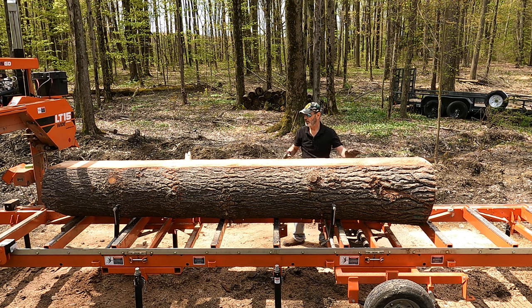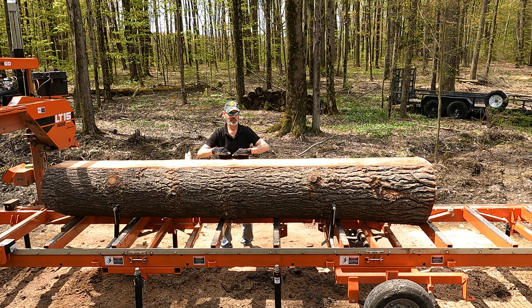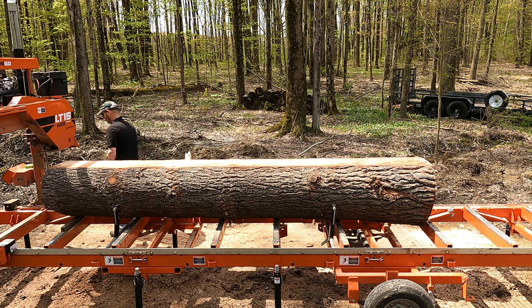And these edge cuts, I'm going to go down an inch and a half now, make a cut. But the cuts on the edges like this, they give you the strongest 2x6s, because this way the wood's not going to want to bend. You know, it'll bend like this, but it won't bend this way very easily when it's at the edge, because the grain is going. So yeah, good stuff.